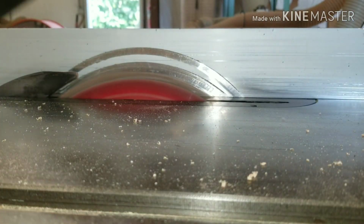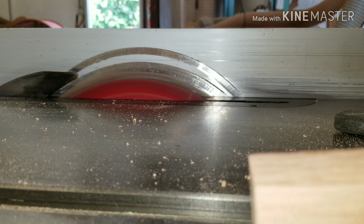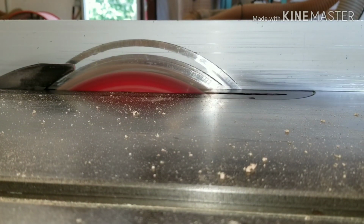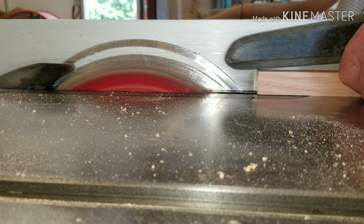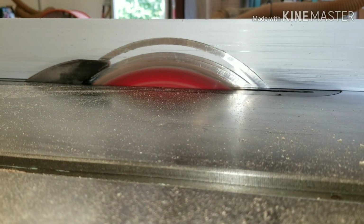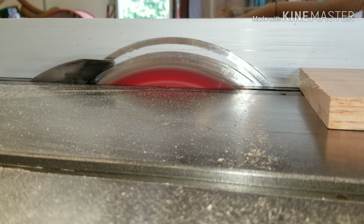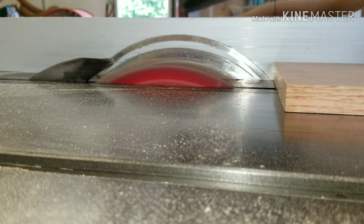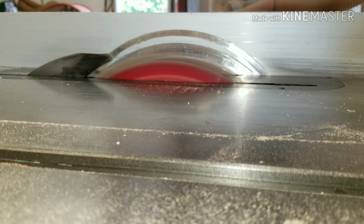And then to make the barrel of the gun flush with the rest of the gun, it needs to be 7/16. I need a piece for the face piece of the other, the handle, the grip. I'm gonna cut this at 2 inches. I think that'll be good. And then we want that about 3/8 inch thick.